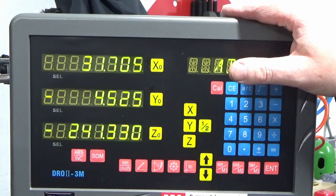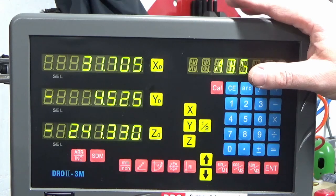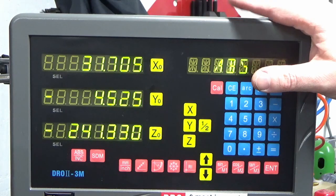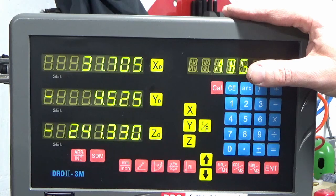So we'll now move on to, I'm just going to centre pop very lightly the 2 holes with a spot drill, and then we'll mark out the part for the radiuses that we need to be hand working on these once I've split them apart.